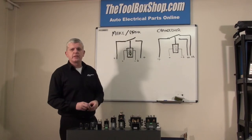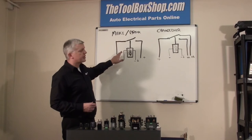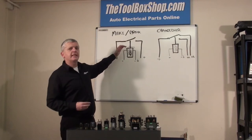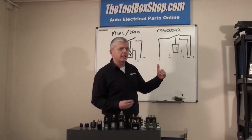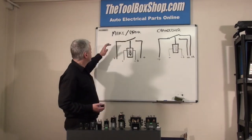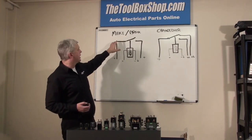Many have probably seen the wiring diagrams for a relay and not realised that the outer lines are thicker than the inner lines. That's because you need less current to switch your coil — to turn your coil on. Once the coil is energised, you're breaking the line which you're using in your circuit. That line can be different amperages, different sized cable. So your main line is the one you'll see as a thicker line on your circuit diagram.